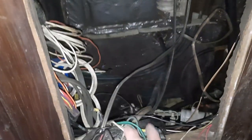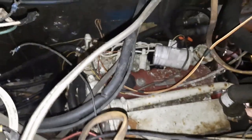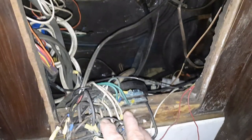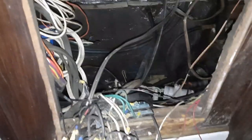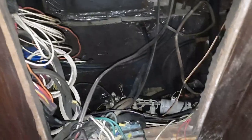But anyways, like I was saying, all the electrical breakers and everything used to be here, the distribution panel. And for some reason, having everything right above the engine just doesn't sound good to me. And having AC and DC in the same area, I'm not too thrilled about that. I don't know, it's probably standard on most boats that you have one area where everything is. So I decided I was going to move the DC away from the AC.